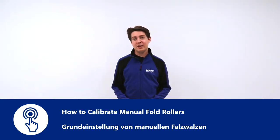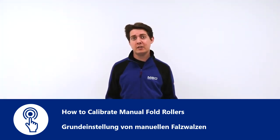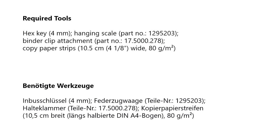In this video we will show you how to calibrate the fold rollers of your folding machine. The procedure is the same for all folding units. You will need a 4mm hex key, a hanging scale with a binder clip attachment for attaching paper strips, and copy paper strips with the shown specifications. Please note that much of the work must be done by 2 people.